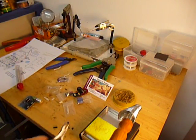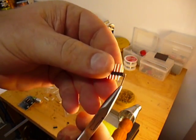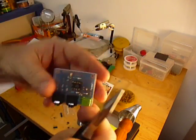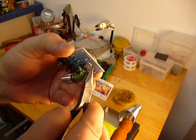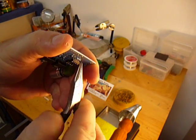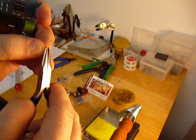What I like to do — because the hole on the PC board is a little bit smaller — is you can take one of these pins out of the plastic. Just pull on it. It comes right out of the plastic, and then you can use this to kind of open the holes up so it doesn't stick so much. It's really difficult if you just try to drop the sockets in there, but if you take one of these pins with your needle nose pliers and just kind of shove it in and move it around, it's a lot easier to get your connectors in later on.